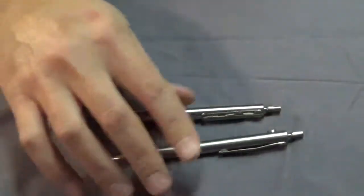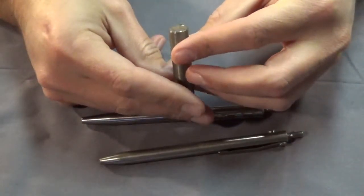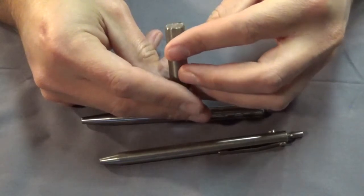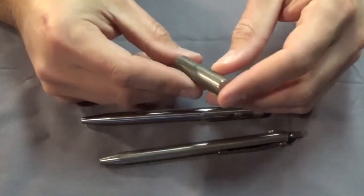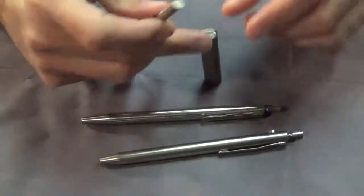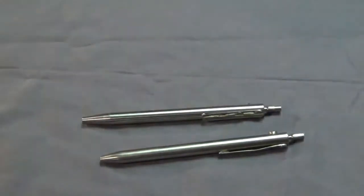Just a little bit about how they're made - you start with some half-inch titanium dowels. Working with titanium is hard; it will gum up especially when you drill it, so go slow. You can use a tap and die set on it too, it just gums up - take your time and don't let it overheat. I used half-inch and some quarter-inch for the plunger on the ink pen.